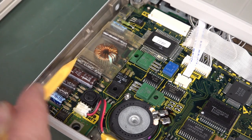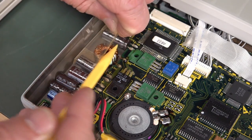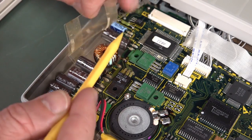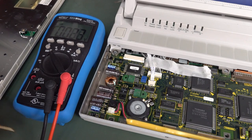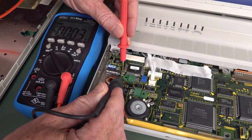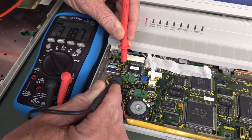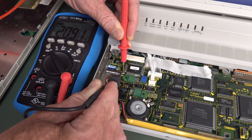I am totally suspecting these capacitors. I'm going to get them out. Unfortunately, I don't have a schematic for this, and the service manual doesn't have voltage test points. It's a pretty good service manual, but not the duck's guts. Let's measure some stuff - three volts... seven point something... jumping between three and seven. One point eight? One point seven? What's going on?